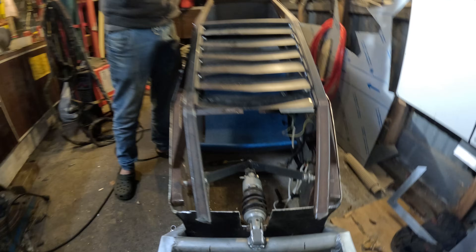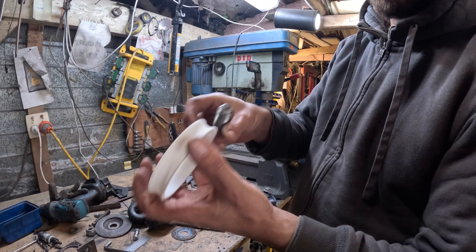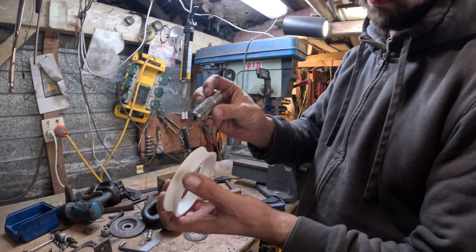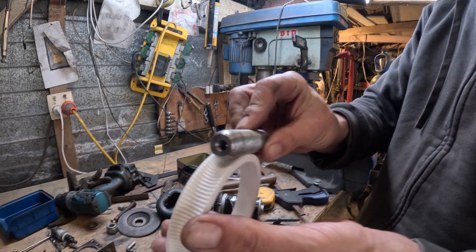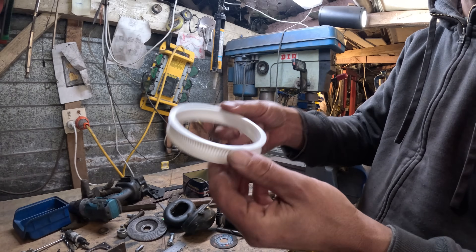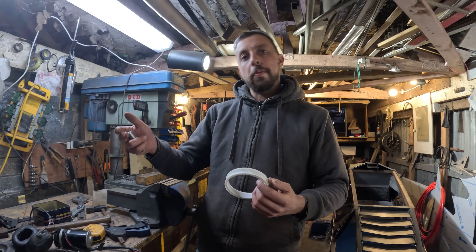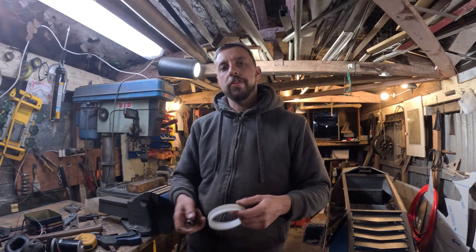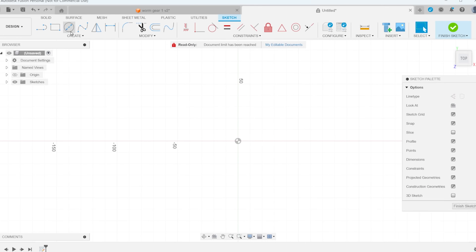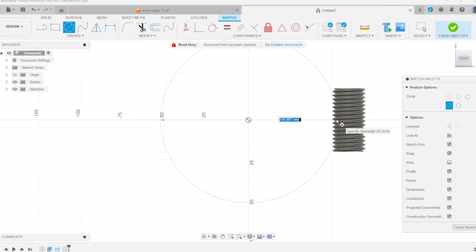I need it to be automatic, so I'll use this motor from the gyro. I've already 3D printed this plastic gear — it's a worm drive. I've got an M20 bolt that's going to mount on there and screw and twist it. I printed this very thin just to make sure it worked out properly. For the CAD: first I draw a 20mm cylinder, then put a metric coarse thread on it, then use sketches to cut away everything except the single thread I want.